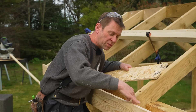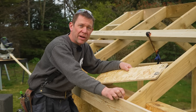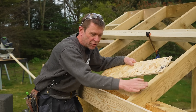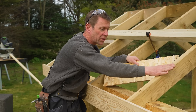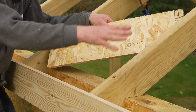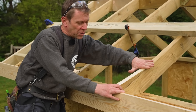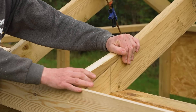On the model here I've just kept the upstand at 40mm to show people. This upstand varies depending on tiles or slates — on slates most tilers I work with don't like any kick, so the slates come straight down. With some tiles we keep this up so the tiles can come down with a slight kick on the eaves tile, just to break the water going into the gutter. Another alternative is to cut sprockets which go on top of the rafters, giving the tiles a nice kick and helping prevent puddling from the felt, getting the water into the gutter.